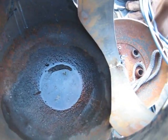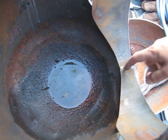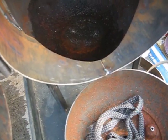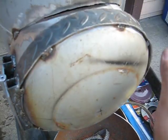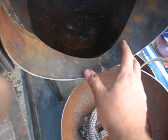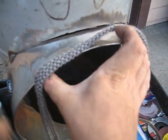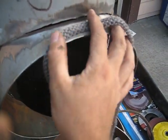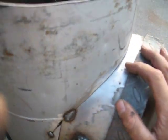In here, I had to adjust this part a couple of times. I actually cut it in half — this right here was solid — but I cut it in the middle down here to adjust the size of this thing so the door closes correctly. I cut out a small chunk here, probably a quarter inch, and welded it together. So it sucked this in because I'm going to be putting a fireproof seal around it so when you close it, no smoke will escape.